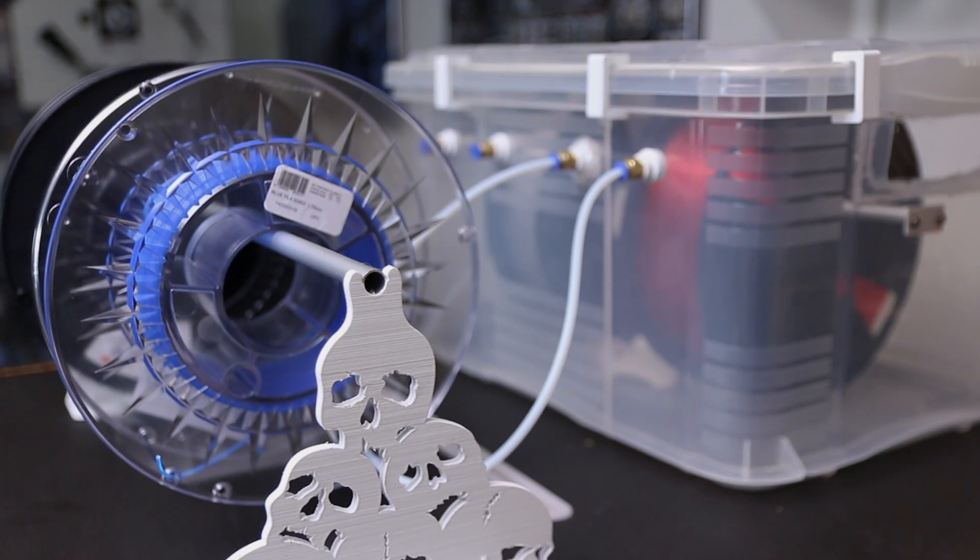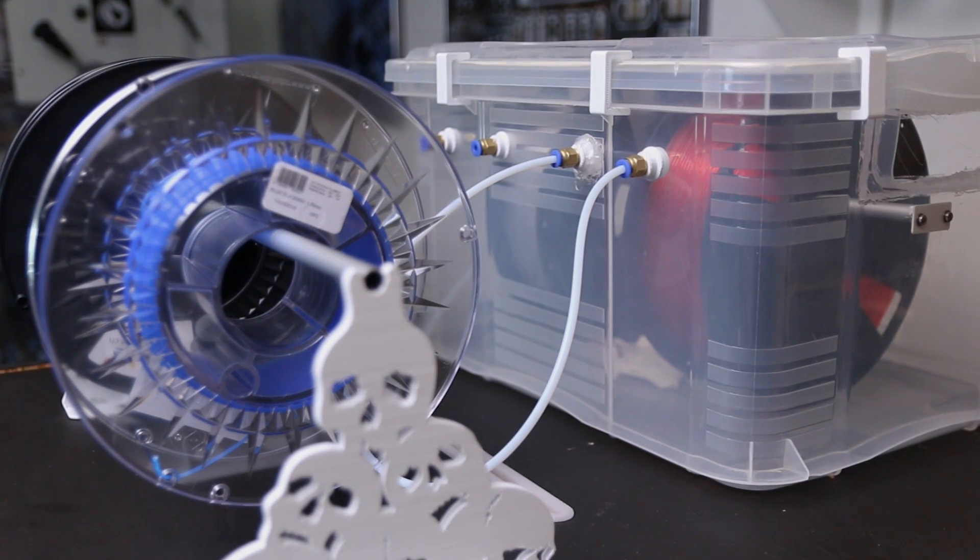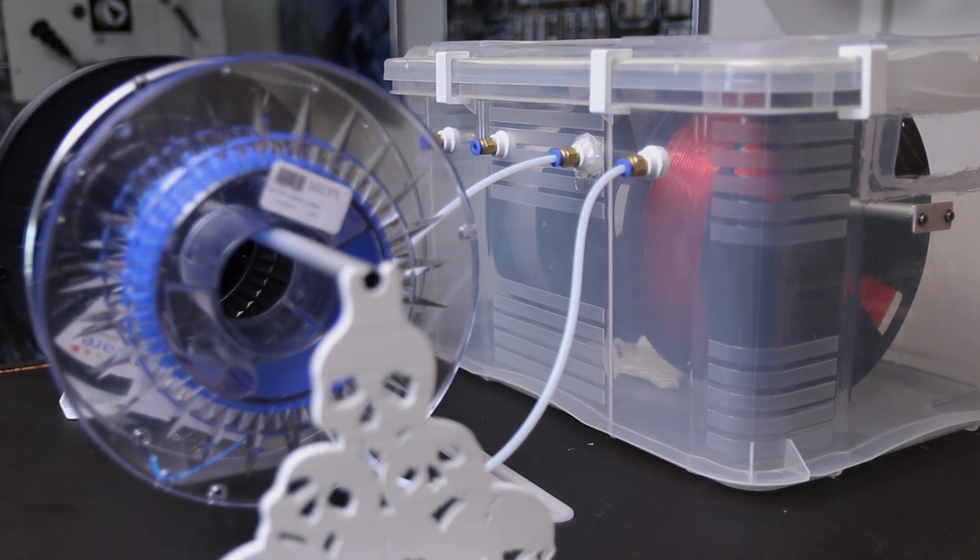One other thing you have to make sure is that your filament stays dry. Polycarbonate is very hygroscopic, meaning it will suck up all the moisture around it if you just leave it out in the air. Once it is moist, on the one hand it will not print as nicely, and on the other hand the prints it does create are a lot less strong. I highly recommend you build a dry box for your filament — I'll have a link below to some good videos explaining how to build one. It's very simple and doesn't cost much at all.